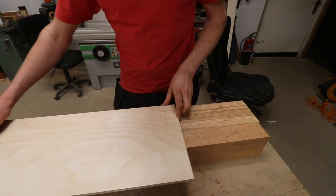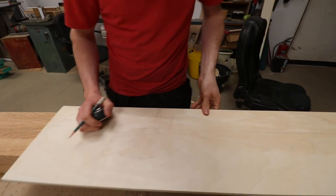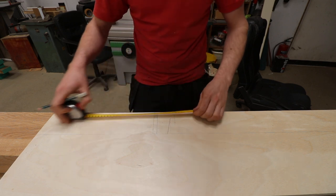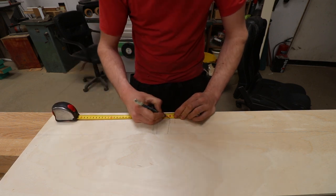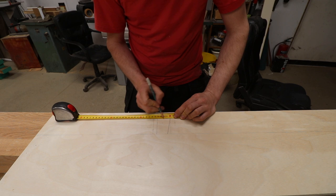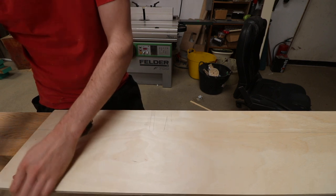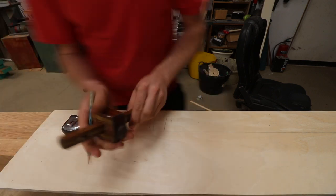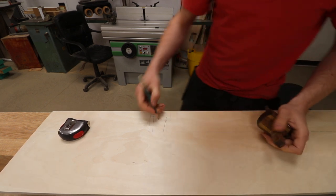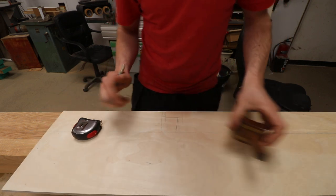So in order to get a stub tenon in there that provides enough security, stop it twisting, and enough surface area to hold it together with the glue, generally I'm going to go from the lowest point and add roughly 20mm as a minimum onto that stub tenon. So as this is going to lose a bit, where's my gauge? Good idea to show you the gauge point here. So the mortise is going there in the window. That's our mortise position, remember, we've set the gauge.